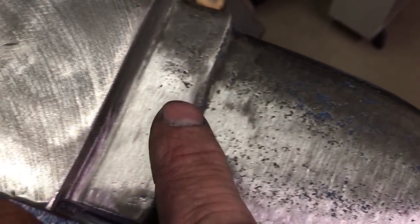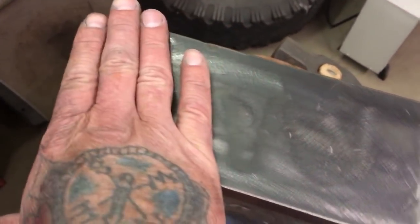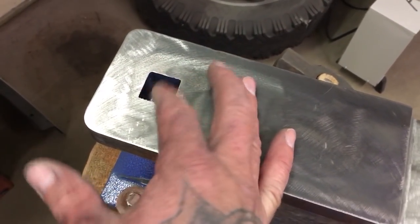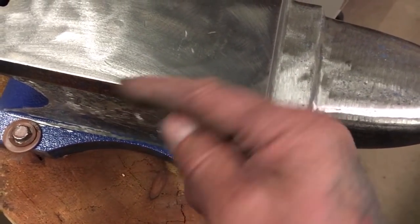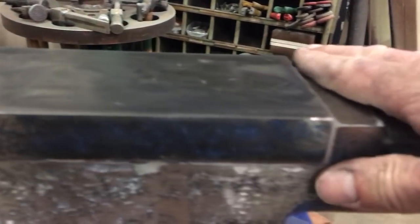You can see there's still a lot of marks in there — it was a lot worse when it had that hammered blue paint on it. So I took my grinder and cleaned all this up, then used a flapper wheel and resurfaced everything really nice. I still need to go around this hardy hole a little bit better because it catches your hand, but I cleaned up all the edges where the casting mark was lipped over.